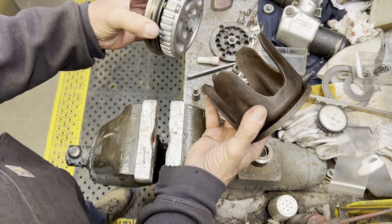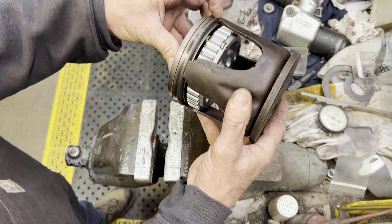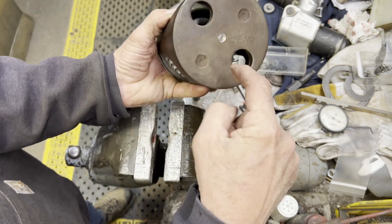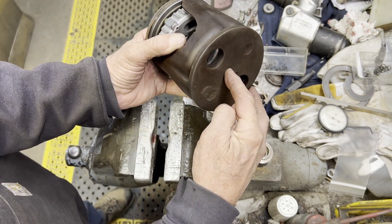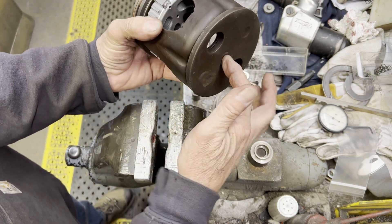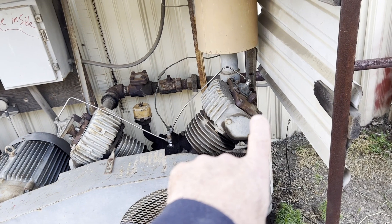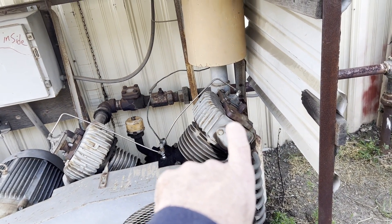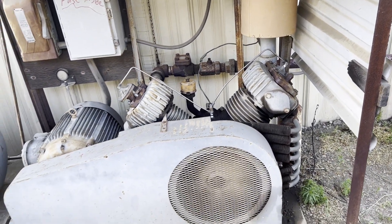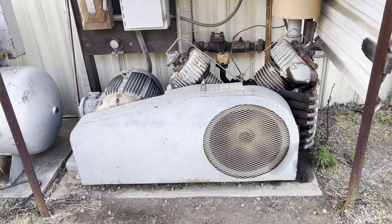Here I'm showing the valve cage — some people may call it a chair. It's the section that basically seats the valve down into the head. The end of the valve will have a copper washer, and right here there's a center bolt that pushes tight and seals up against that copper gasket. That big cap has four bolts that tighten up and seat on the gasket. Then the center stud pushes against the chair and seats the gasket, and then a little acorn nut seals off the center bolt.